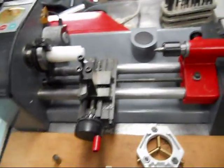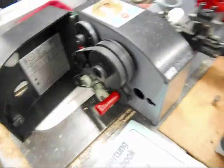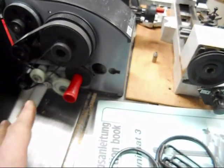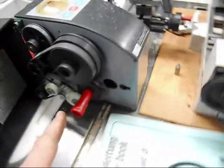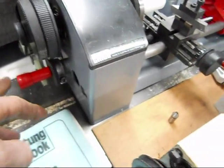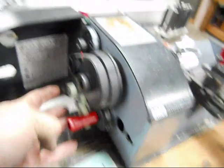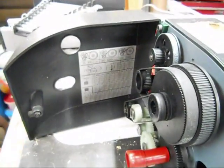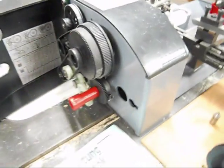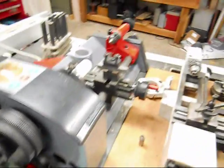So those are the similarities and differences between the two. I should also mention that the Unimat PC has a full gearing system for driving the carriage at various speeds, controlled by the gears used here. There's a full chart — much like a full-grown lathe would have — for setting up the gearing on the carriage drive.